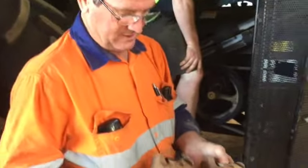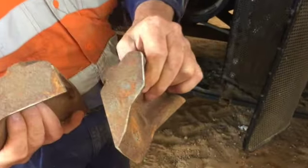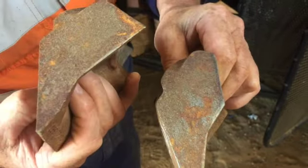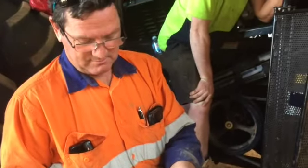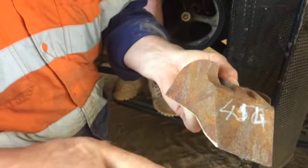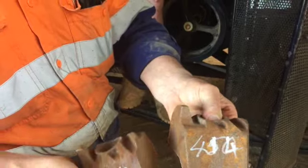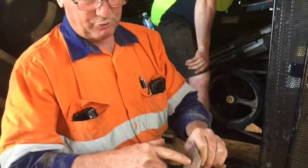411, 414 — so it was 450. Had to cut the chunk off the corner. Don't cut this edge, because the material flows past this edge as we're working it. And if we cut a big piece like this one — because it was a big difference — we cut almost 40 grams off it and put it at the back of the rotor.